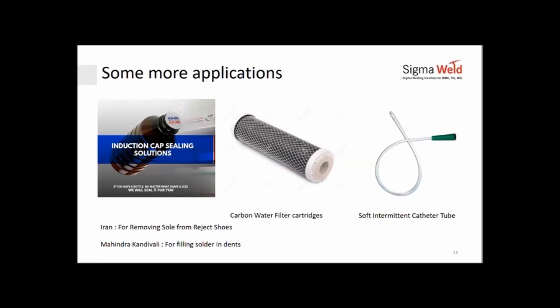It's very difficult to do it with a general process. Through induction, we put a small washer on top with a preset glue ring, put the assembly in place and just let it go under a conveyor, below the induction coil. The induction coil will only heat the metallic washer. The washer has perforations in it. It melts the glue and forms a bond on the fly.